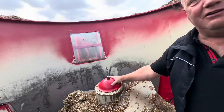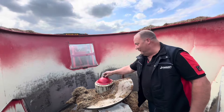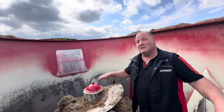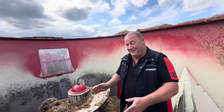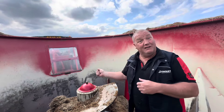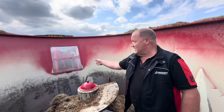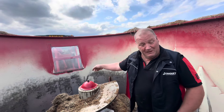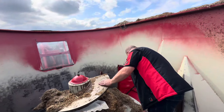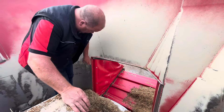It's usually foreign objects rather than bales. You asked the question off camera about underneath — if you noticed when Joe was underneath, there were no guards on the PTO shafts under there. That's because it's a welded cavity under there, so there's no need for a PTO guard. When you come to grease it, there's no taking off PTO guards — it's just there. If the factory's done the job right, you set the first yoke in the first machine in the correct position, it should be right for greasing all the way through.